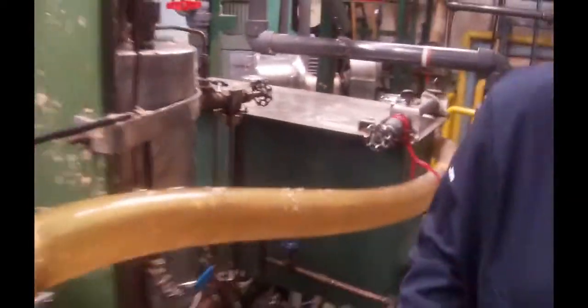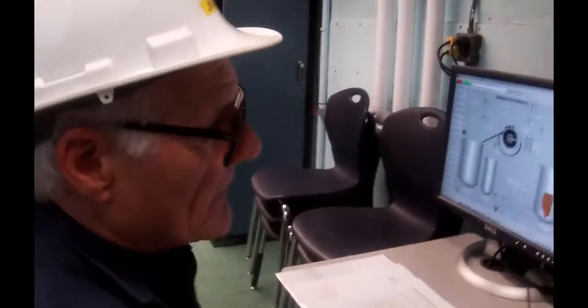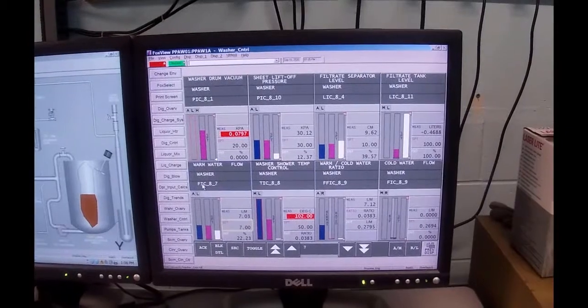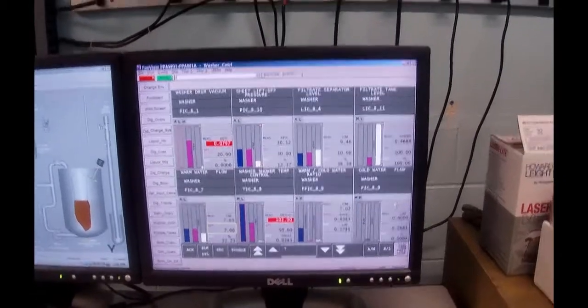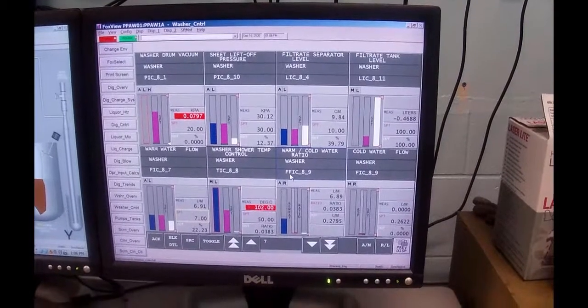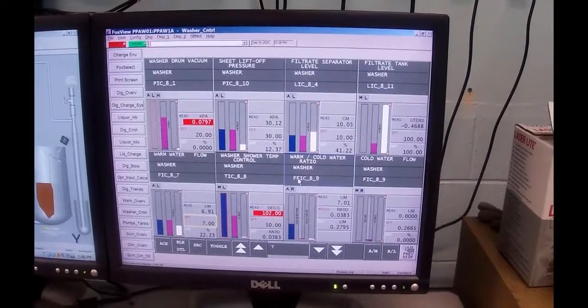And you'll see now that the level is down here and the inlet is up there. So we're coming in above it. Okay? Good. So this you recognize is a pressure indicating controller, a level indicating controller, flow indicating controller, temperature indicating controller, another flow indicating controller. This is the cold water flow. This FFIC, instead of being 3 letters, there are 4, which means one of them is a modifier. And that second F means it's a ratio. It's a flow ratio indicating controller.